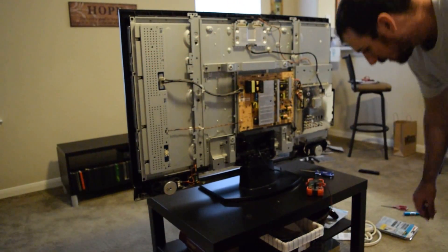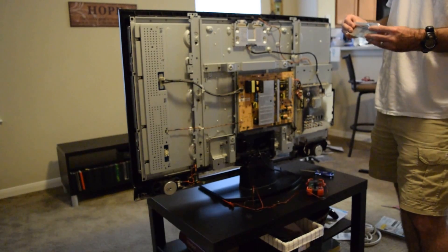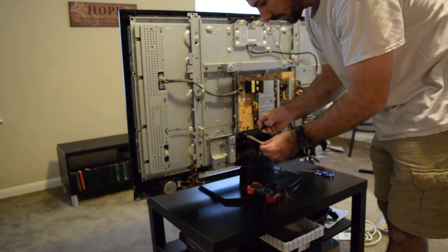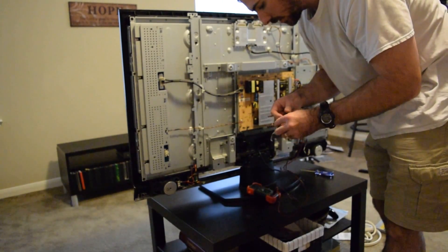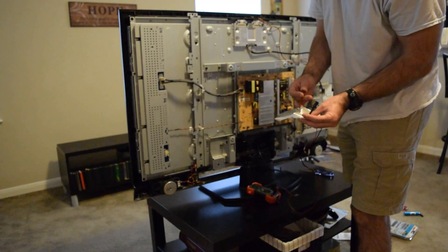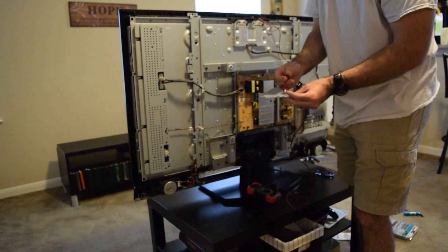What I have here is a piece of what's supposed to be RF shielding applied up here — it's basically just adhesive-backed aluminum foil. The problem is that in order to provide RF shielding it has to be grounded, and the adhesive on here is non-conductive. I've got a meter out: I can clip one lead onto the foil and touch the back adhesive and I'm still getting an open circuit. But if I go over to the foil itself I get a closed circuit. Turning on the continuity check — here we have a connection, but against the adhesive we do not. So as far as RF shielding goes, this is absolutely worthless.